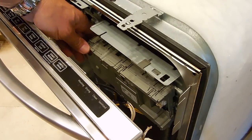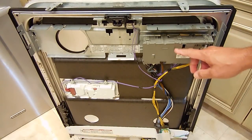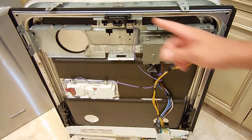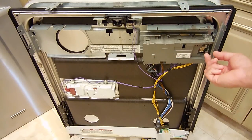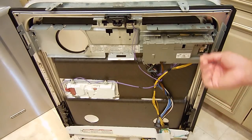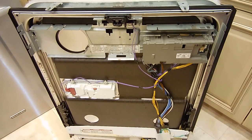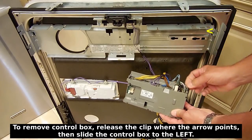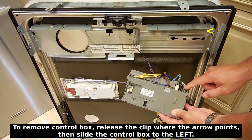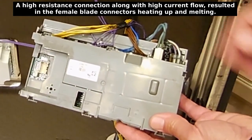When I pulled it away to take a look, I saw exactly what the problem was. Right over here is the control box — two connectors from the panel, which you push all the settings, plugged into this control box right here. You simply squeeze them to remove them. Now let me show you on the very bottom here what the problem was and what that burning odor was coming from. You can see these wires look okay, these wires look okay, and over here they do not look too pretty at all. Power is disconnected, of course, before you touch any of this.